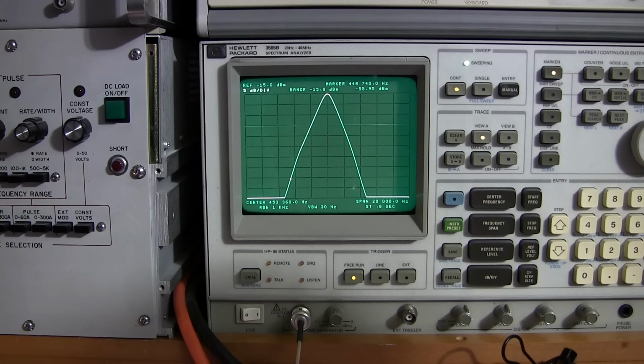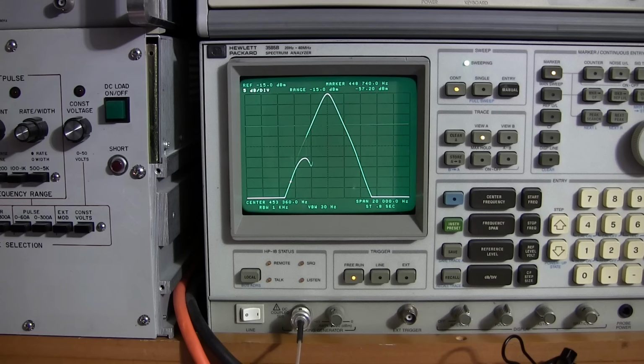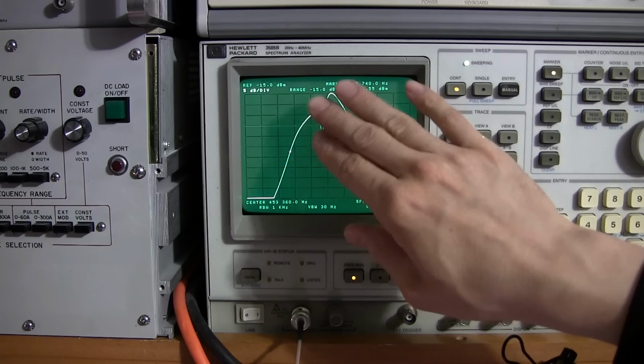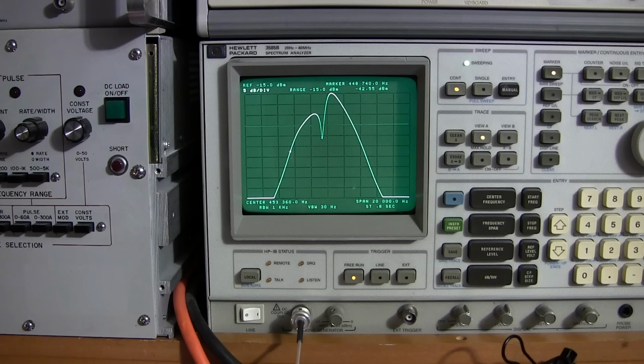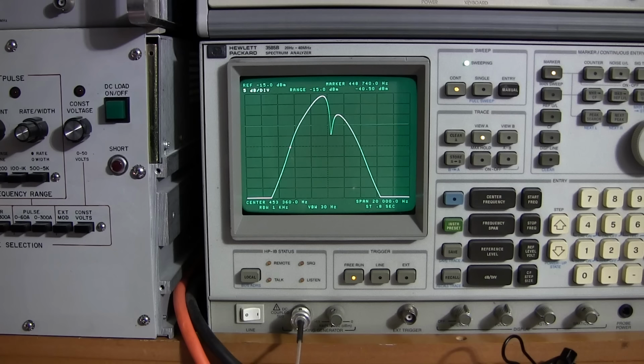Now, when I move this to one side, we should see a notch pull up on this side. All right, so I'll just move this over. And you can see that notch, down the gain here a little bit. You can see that notch pulling up on the one side. So again, we would want to get rid of our offending frequency by pulling this notch up on one side. And then if I return this back to the arrow, which would be at 12 o'clock, we're going to be around here. And then if I go the other direction, turning the knob towards the number 10, you should see a notch pull up on this side here. And it should be relatively even from both sides.